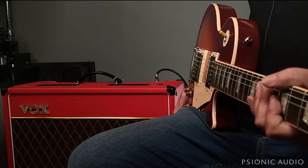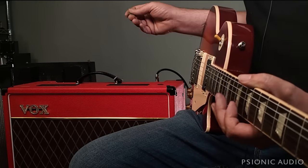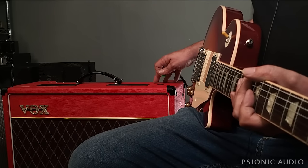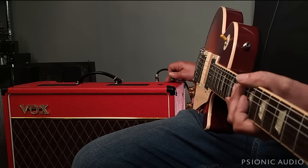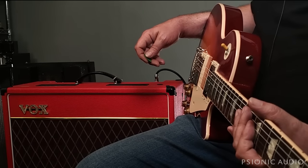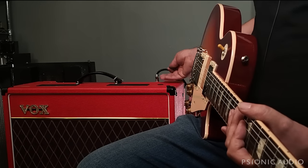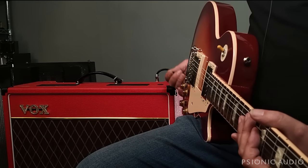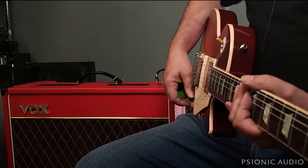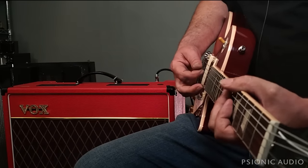Not as full sounding as the non-treble version of the channel, but most people are going to like this. The non-treble version of the channel can also be a bit dark and to some people a little bit boomy. So, you know, it is one of the historic flavors. I think it is the wimpiest, and I change it, in fact, to be more like the actual input response of the vintage AC15 when I do these, which means it has the gain of the non-treble version normal channel the JMI did, but it has the low-end response of the AC15, which is not as boomy as the AC30 normal channel. So you get in between the two. But, you know, it's not a bad stock form.